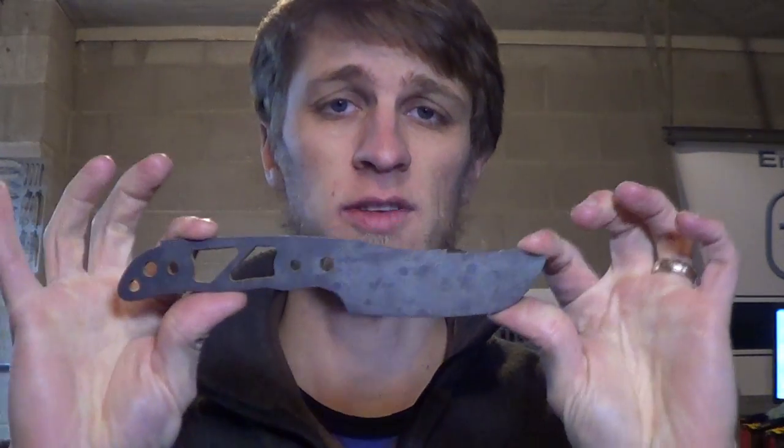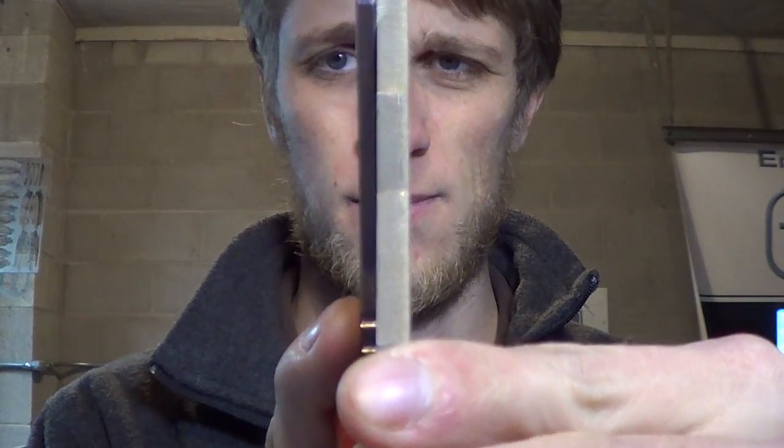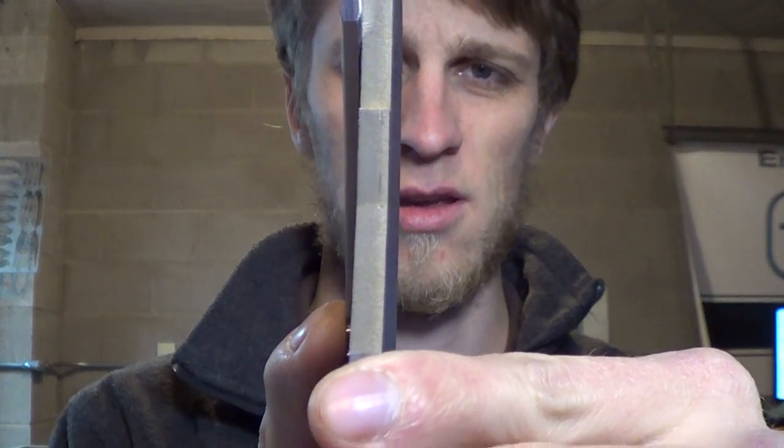We've just been taking some footage of that and going through the process but having quite a few problems with goofy mistakes and all that. One of the unfortunate things about this 5160 steel is that this is the thinnest you can buy it in — .215 inch. It doesn't come any thinner than that. It comes thicker but no thinner. And when you're trying to make a knife, my goal here is 156 thou. That's a lot of material to remove.